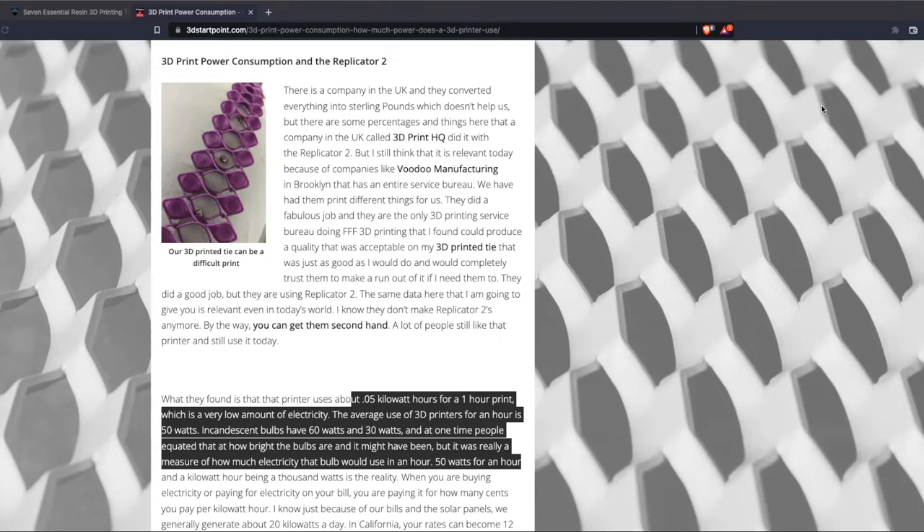It's not pulling that 300 watts consistently — it's every time it cycles on to expose a layer. It's only on for about a third of your total cycle time per layer, since the rest is the Z-axis moving and resetting. You can turn down the power output — the light sources support PWM. AnyCubic is the only brand that exposes it, well, ePax does as well. Those are parameters inside the sliced file; you just have to set it in your slicer. Most people would run 80% power, so you're drawing 240 watts instead of 300.